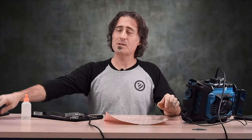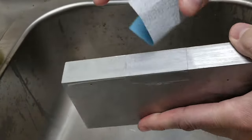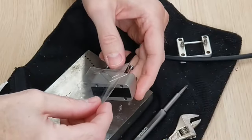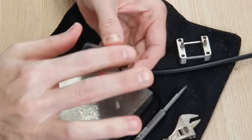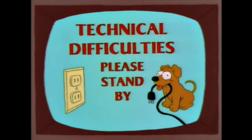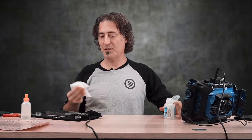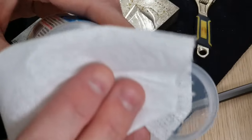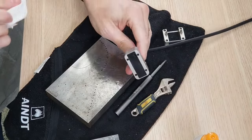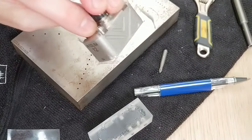You could also put a protective tape on the face of the transducer, not unlike what we do in eddy current with a Teflon tape to protect the probe face. I'm going to try this out and also use gorilla tape in a completely unscientific test - I've got each one taped to an aluminum block and I'm going to sand the daylights out of it. The gorilla tape seemed to last a little bit better. So with everything completely dry, I wrap it over the face of the transducer making sure there are no air bubbles - and that totally did not work. That's one for the blooper reel. I forgot that oils from your fingers and little remnants of couplant will keep that from sticking. Now that this is nicely cleaned up, we'll try that again and it sticks no problem.